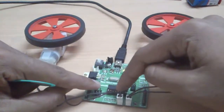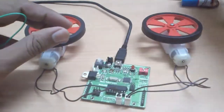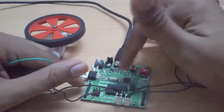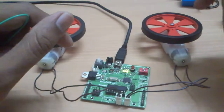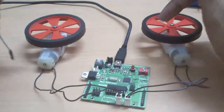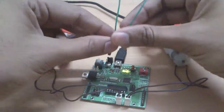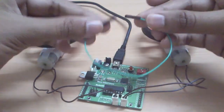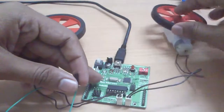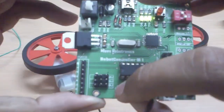You'll notice the motors are not running. This is because the L293D IC motor driver has two different inputs: one is the 5V supply which drives the IC itself, and the other is a 9V supply — when connected to an external power supply, that source runs the DC motors directly without regulation, allowing higher speed. But when powering from USB only, the motors don't run as-is.